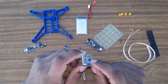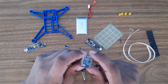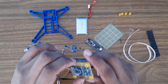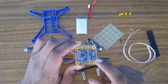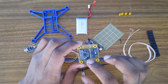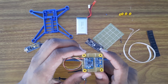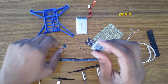The GY86 has an accelerometer/gyro sensor, the MS5611 barometric sensor, and the HMC5883L magnetometer. For this project we will only need the MPU6050 accelerometer and gyro sensor and also the MS5611 barometric sensor. If you can't get this board, alternatively you can combine the MPU6050 and the MS5611 barometric sensor on separate boards connected together to make a single board. You will need both of these sensors for this project.